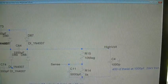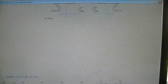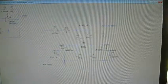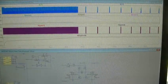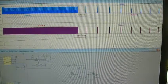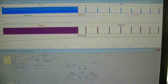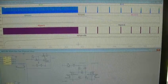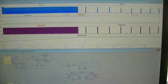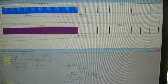That's the new design. In simulation it reaches 4000 volts very quickly — in about 4.7 to 4.8 milliseconds. Previous topologies were not working nearly as well. The sense signal gets out there but doesn't drop immediately to zero as it should — it's not shutting off as fast as expected.